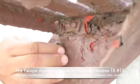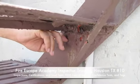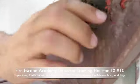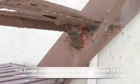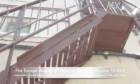Another issue you're going to have when dealing with fire escapes is that anything 1978 or older is subject to — look at that, look at all that rust. Somebody just painted over that. Anything 1978 or older is going to be lead-based and have the EPA renovator's requirement to maintain and control all the lead paint.